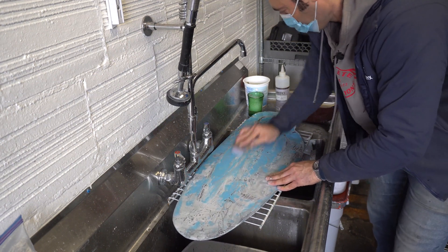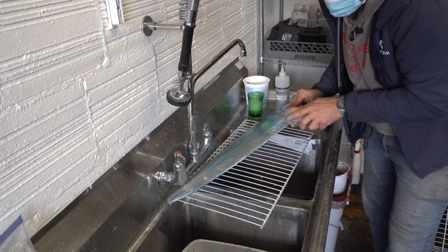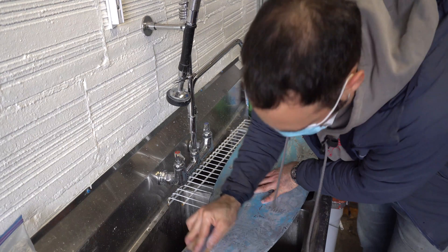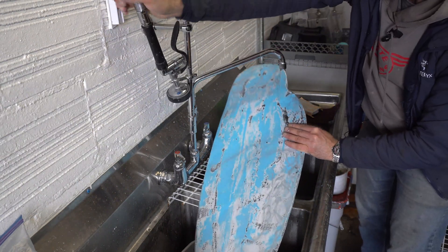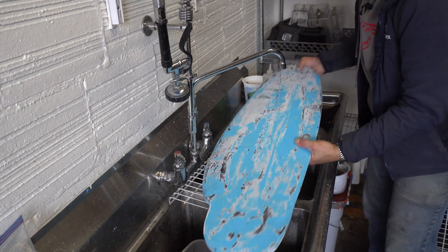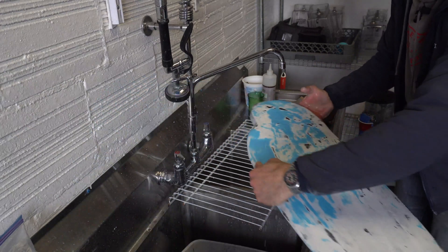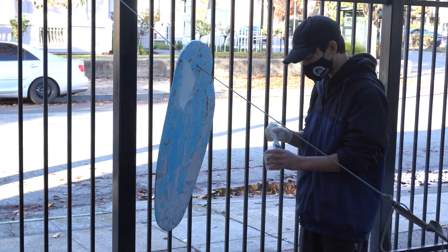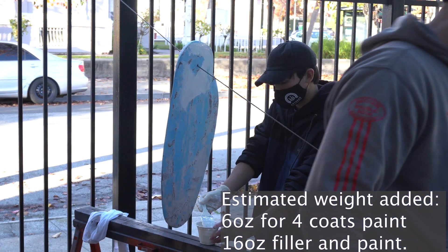There's a nice paste going and I'm moving around the paste — not so much sanding, but just polishing, giving special attention as I polish the blade. I'm trying to pull particles into my filtration system if possible — trying to keep the microplastics down. Really nice. You can see all three layers there and how water comes off of it. I believe in this sleeving and the butcher block method, but I believe that you have to anticipate how to get the least amount of highs and lows.